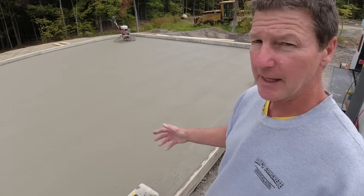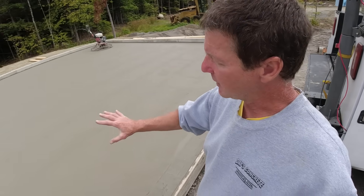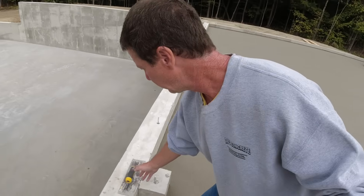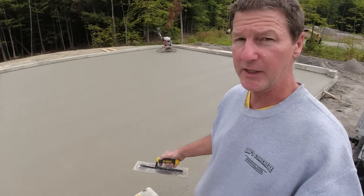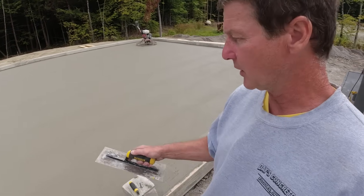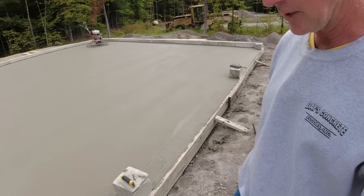On a day like today I'll give that about 20 minutes and check it again, then I'll go the other way — same pattern but 90 degrees — and that helps flatten it even more. Right now I'm going to take my steel trowel, go around all the edges I can reach, and smooth them out even more. Since the concrete has set up a little more they're going to keep getting smoother. To stay ahead of the game I'll go do my edges and get my garage doors really smooth. Sometimes the garage doors have set up enough that I can get my broom finish on them.